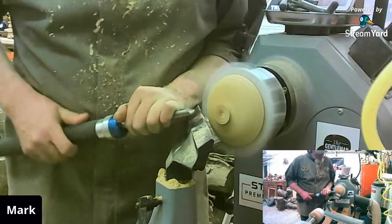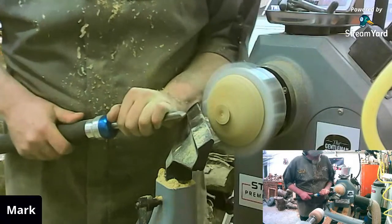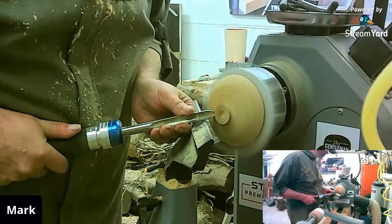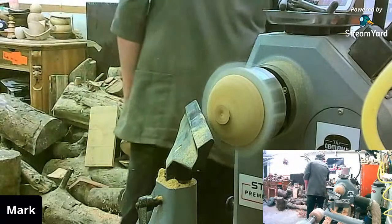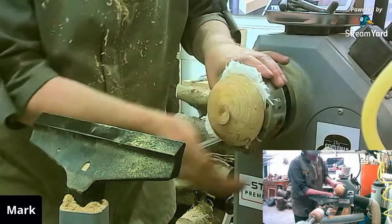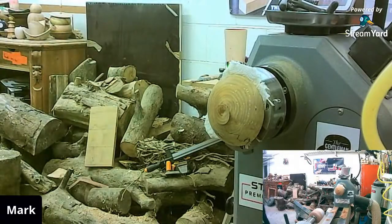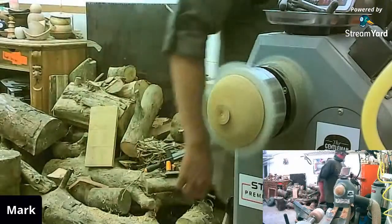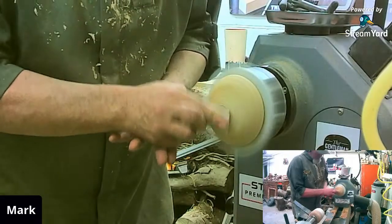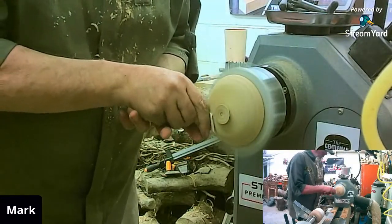Super Dust Deputy, 4-inch cyclone. Yeah, I've got a 4-inch cyclone on my extractor, and they do really draw well. Really good at separating the stuff out. I bang my filters out every, say, 2 to 3 weeks, and there's hardly anything on the filters, just a light dust coat over the top of them. I did mine once when I seen you installing yours, so I jumped in and got one as well. They are well worth the money, for £100. The thing I like about them is they're metal and they're in two halves, so if you do get a problem, you can take it apart and clean it. 100mm as well, so you've got no reduction on them, straight through.